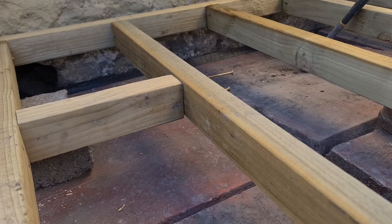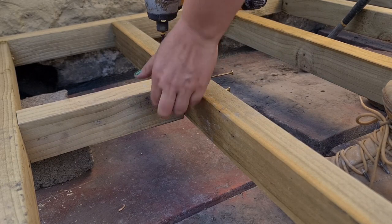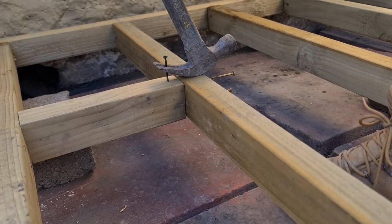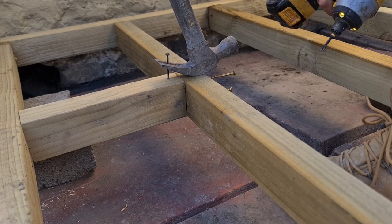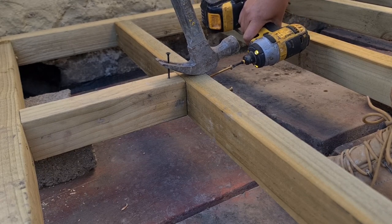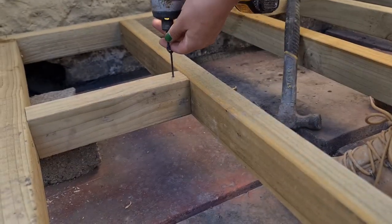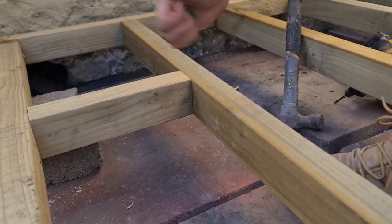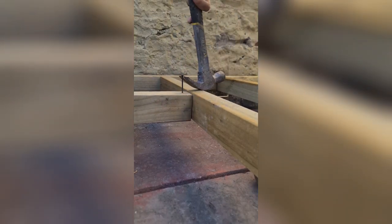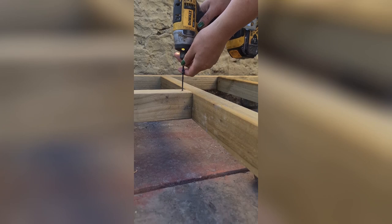I've done a few noggins and I've completely run out of steam for today, but before I go I'm going to show you this amazing hack that I think is super helpful when joining pieces of wood together. If a piece of wood is too low down and hard to raise by hand, you can screw in a screw and use a hammer to gently pull it up so that it's flush. Once you've got it in the right position you use your screw to drive it into the wood, then take the screw out and it's fine. I also created a short-form video of this and posted it to all my socials last week — it was very popular. As always, if you enjoyed this video don't forget to like it and subscribe to the channel.